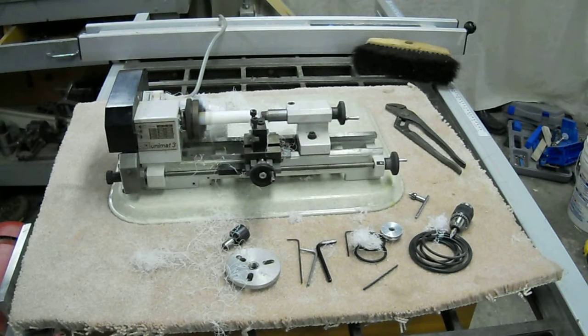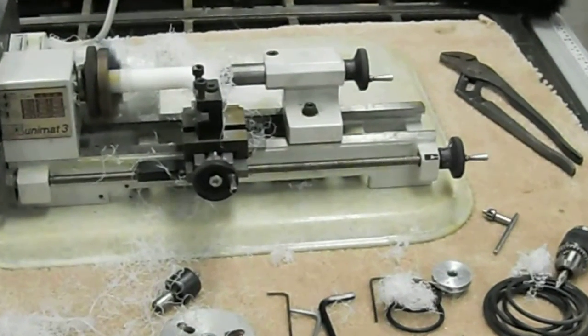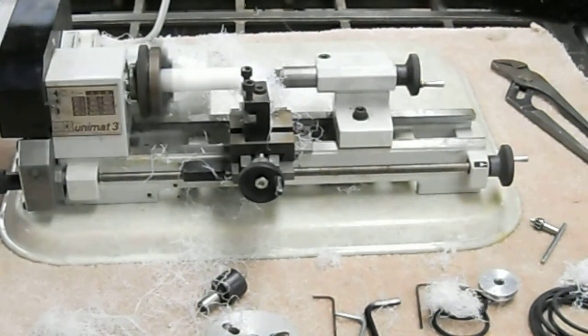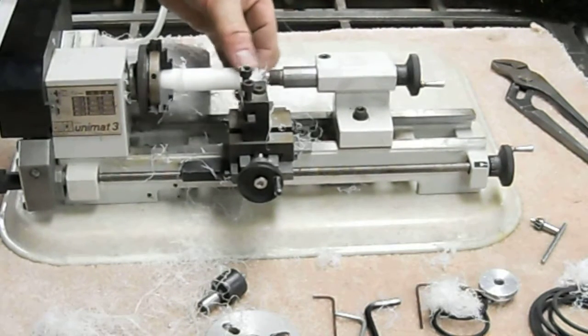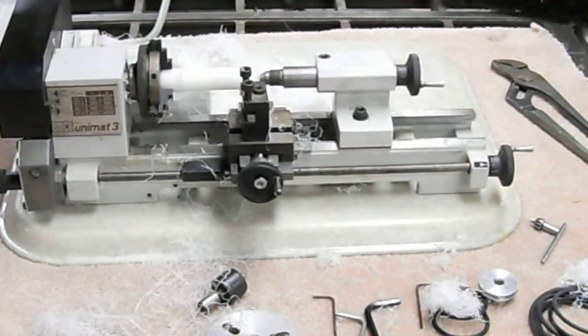So that's the longitudinal feed in action — the z-direction. I'll zoom in a little bit so you can see it. That longitudinal feed is a nice optional accessory you can get with the lathe. I'm going to turn it off here, clear the swarf. That's probably about a 15 thousandths cut, though I think it cut quite a bit more than that.